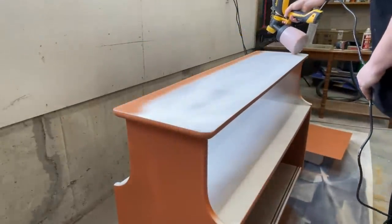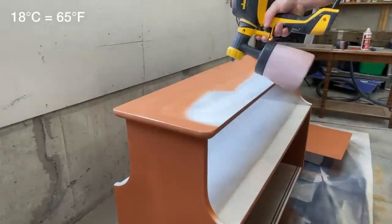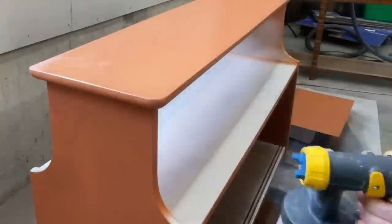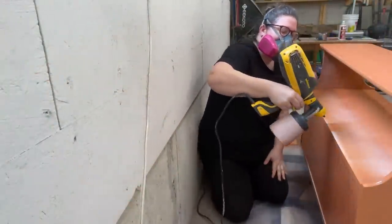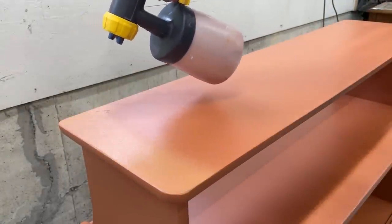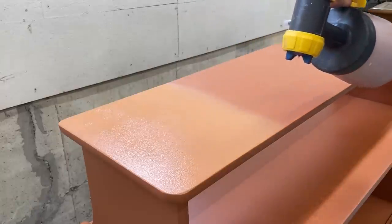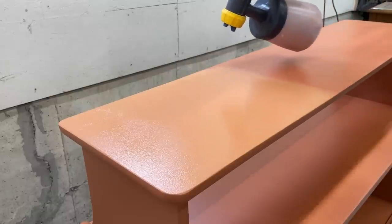After spraying my first coat upside down, I flipped the cabinet over and sprayed another two coats, waiting those four hours in between. By this point in the day I had the heater in the garage running, so it was about 18 degrees in there. I also had my box fan blowing the warm air around so things could dry out faster. This paint takes a lot longer to dry and cure than the chalk style paints that I usually use, but it doesn't need any additional top coat. I'm not too sure that I'm going to be reaching for it again because of the long dry time and also because it smells like paint. And if I make a mistake or get a drip, I can't sand that out. But it did get the job done on this one and I'm glad I gave it a try.